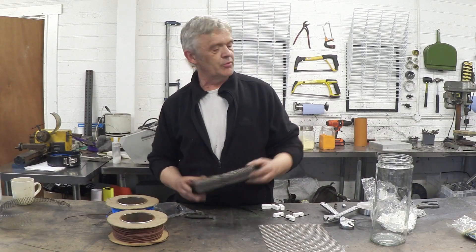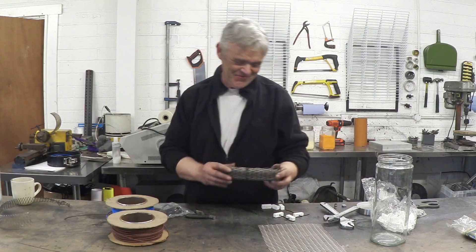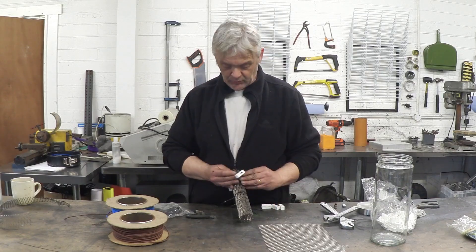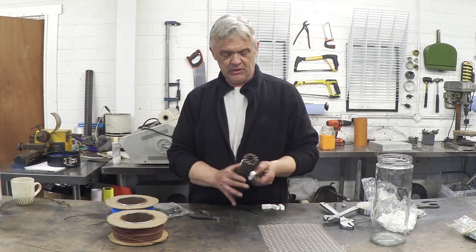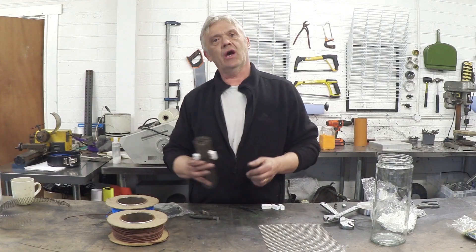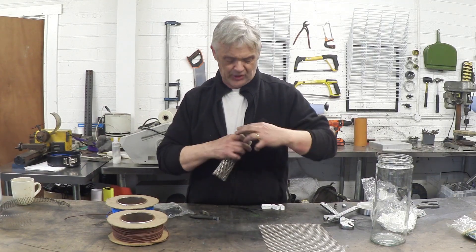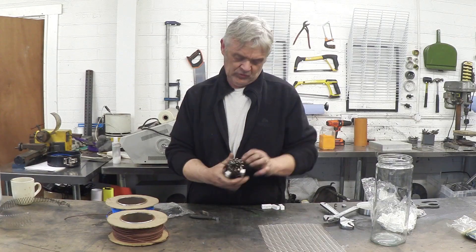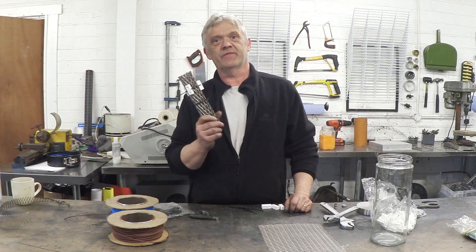The minute you finish rolling it, it's going to want to unwind, so secure it with some cable ties. That's the centre one secured so we can handle it. We can't just drop it in and leave it because these things always want to move, so we want to put something on there to stop it touching the other electrode. The easiest thing is to put some plastic spacers on — these are kitchen cabinet corner blocks. Position three of them around it, then pull your cable ties tight. That will act as a spacer to prevent it touching the other electrode.